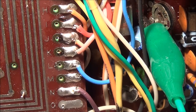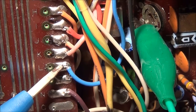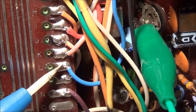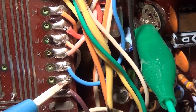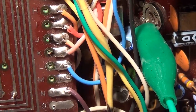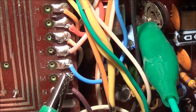According to the schematic here, this blue wire goes to the signal strength meter. And this here is supposed to be connected to this — it's probably connected by a bridge on the other side. There's supposed to be a gray wire coming up here, because when I take the alligator clip and clip it onto this terminal, the signal strength meter works again.